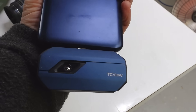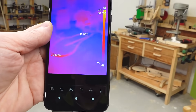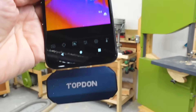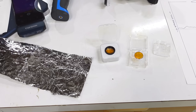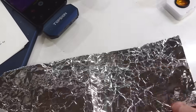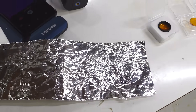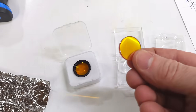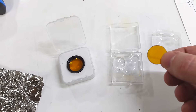With a thermal camera like this one, the infrared heater radiates a lot, but so does everything else in the room, and the room is actually cooler than the camera is right now, so the camera is irradiating itself. Just about everything emits infrared radiation if it's a little bit warm. The only exceptions are materials that are highly reflective like tinfoil, or materials that are infrared transparent like these infrared lenses here — but they just pass on radiation coming from somewhere else.